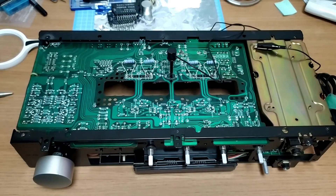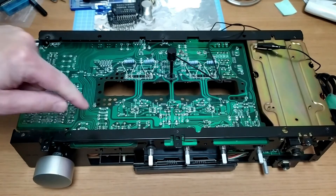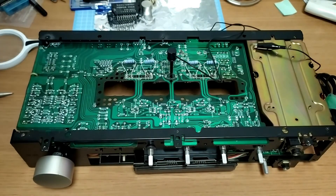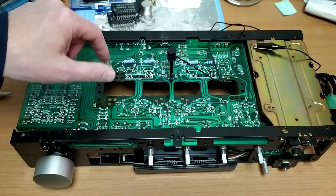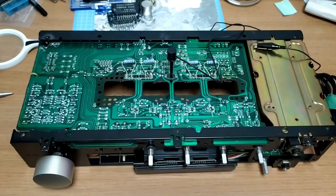That indicates this circuit is probably okay — there's probably nothing wrong with the board at all. So all we really need to do is wait for some new power packs to arrive and we'll see whether I've wasted my 15 bucks buying those from AliExpress or not. I've also replaced these transistors and checked the voltages on those, and they're checking out much better too. Between pin 1 and the collector they're roughly the same value — the datasheet says about 1 to 1.2 volts; I've got about 3.7 here, probably because we're using resistors and not the actual power pack. But it's indicative only — it's a diagnostic tool — and thanks to the guys at Audio Karma for the tip.